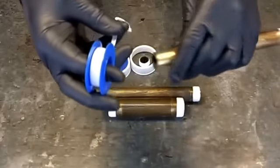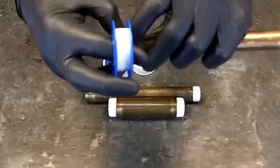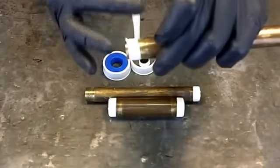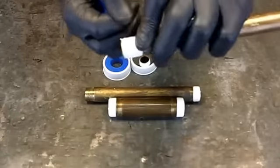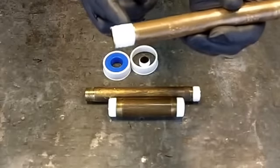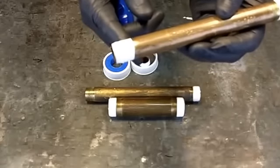What I see a lot of guys doing — and I'm not saying whether this is right or wrong, but I just don't think it looks nice — they'll start and wrap all the way to the back end of the threads. When you screw a pipe in, there's no way you'll screw it all the way in, so you end up with this kind of white racing stripe on the pipe, and that just looks terrible.